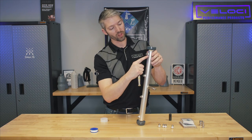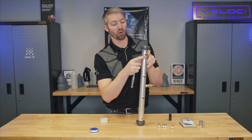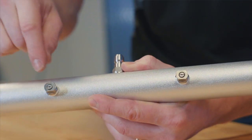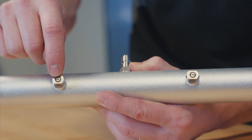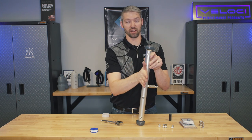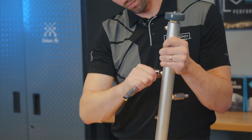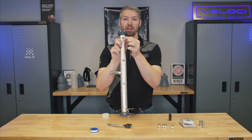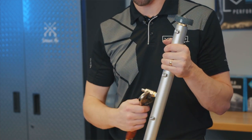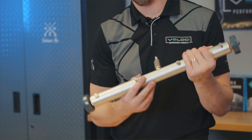When you look at this, you'll see I've only hand-tightened these. Some nozzles will thread a little further than others, but the most important thing is that the nozzle spray pattern lines match up straight up and down. If they're crooked, the spray shoots off-angle, and when one side shoots straight and the other shoots sideways, you're going to have uneven spray patterns. So make sure your lines always match up so all spray patterns align. Last piece — tighten down your pre-filter. It does not have to be very tight. It's all NPT.